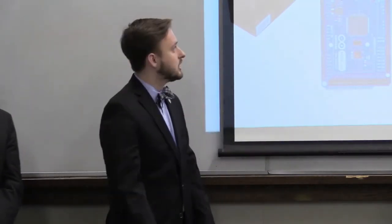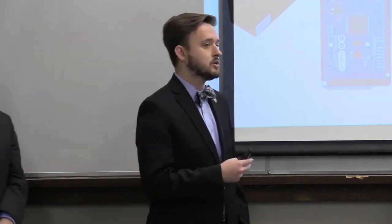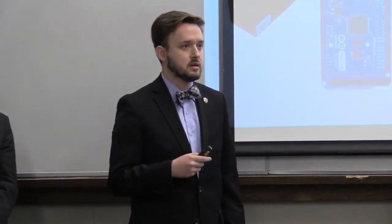Now let's look at how the electrical system actually works. We have a PS3 controller that communicates over Bluetooth with an Arduino microprocessor that has a Bluetooth interface. The whole system runs on a 12-volt battery supply, standard across all Valpo Robotics team members. This microprocessor provides control input to three Victor 888 speed controllers — two of those control RS550 motors for the drivetrain, and another is interfaced with an IR sensor to detect whether a football is in the kicking tee, controlling whether the kicking motor actuates. This kicking motor now operates more as a starting force for the kicking mechanism, since the surgical tubing takes over mid-swing.